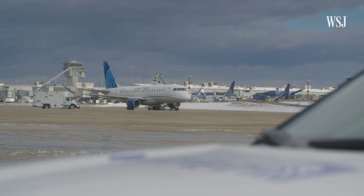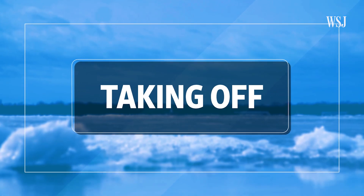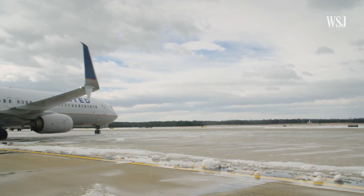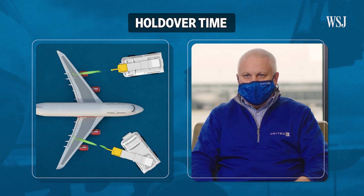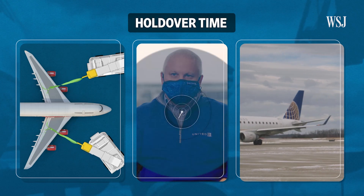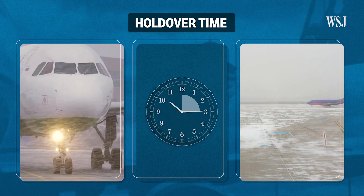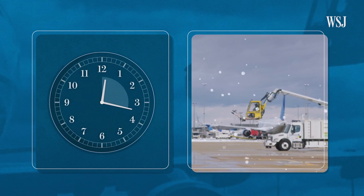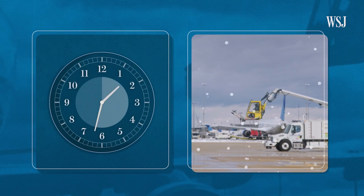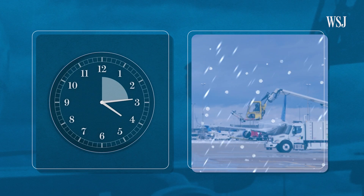But the protection from type 4 only lasts so long. It does not protect you in the air — it protects you getting to the air. After planes leave de-icing, a clock is set with something called holdover time. Holdover time is the amount of time from when you sprayed anti-icing type 4 to the time the aircraft actually starts rolling down the runway for takeoff. Holdover time is determined by precipitation, temperature, and aircraft type. Generally, the wetter and colder it is, the shorter the holdover time. If it's just a light snow, you can actually have a 2 to 3 hour holdover time. If you have freezing rain, you will have maybe up to 15 minutes of hold time.